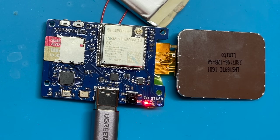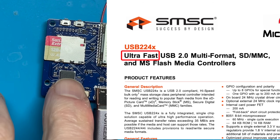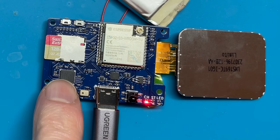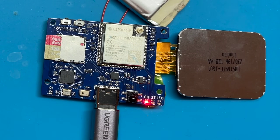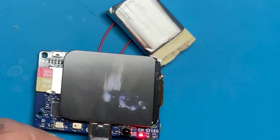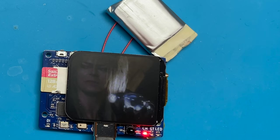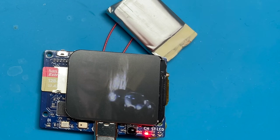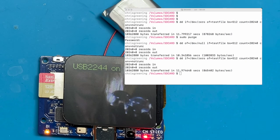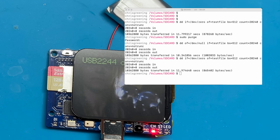What I did was add the USB2244 chip. That allows us to hand off the SD card to the USB2244 and have that talk over USB, which should be much faster. I've flashed a sketch onto the ESP32 and it's just playing an animated GIF. I've wired up the boot button so when we hit boot, we switch over to the USB2244 and hand the USB over to it. So let's hit the boot button - we've got USB2244 on and we can see its activity LED.